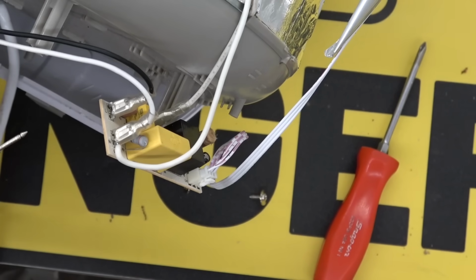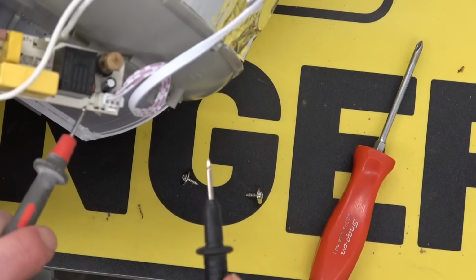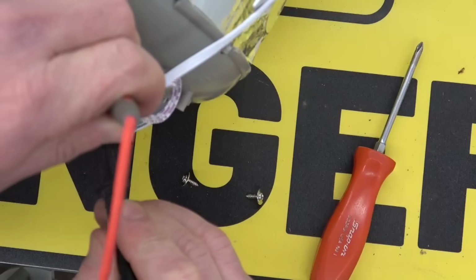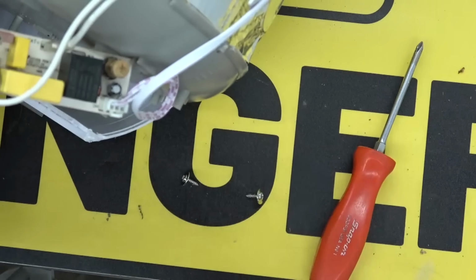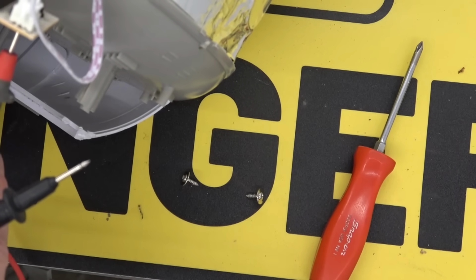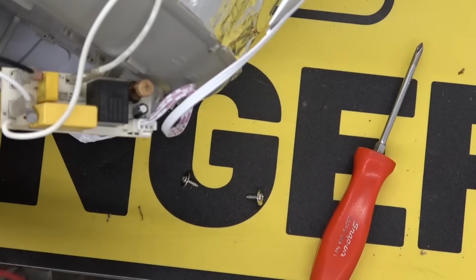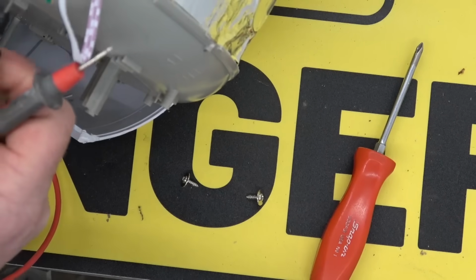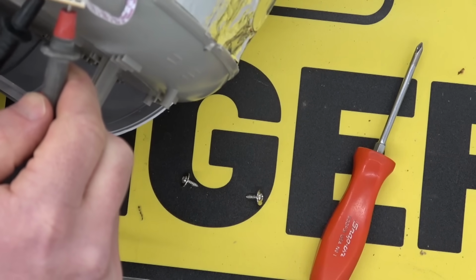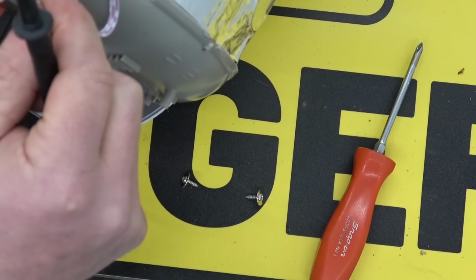We're going to have to wake Thelma up and fire up the mystery machine. Find some more clues. You can start checking diodes. That diode's working and biased properly. That is, it only allows direct current to flow in one direction. Let's check that diode. Swap the leads. Oh, okay. So we swapped the leads on this diode, and it conducts in both directions, which means that the diode is fried.